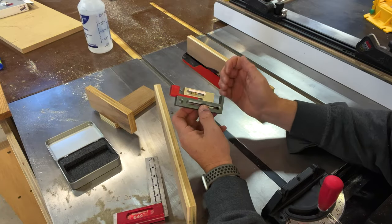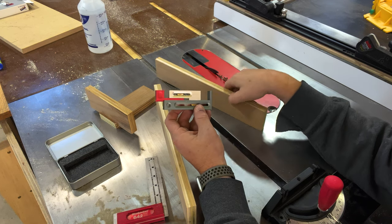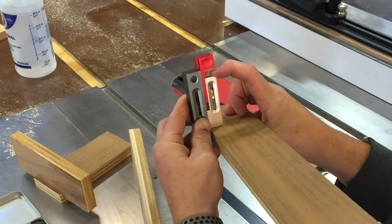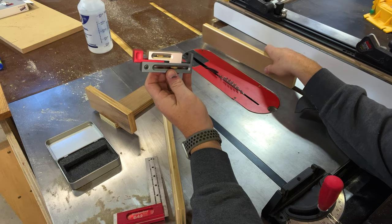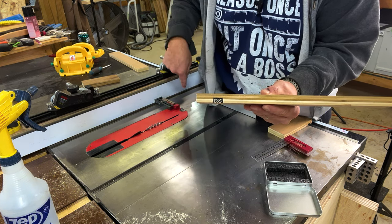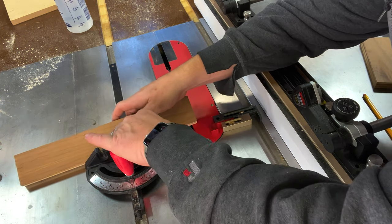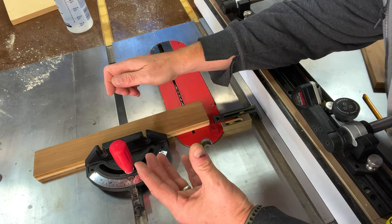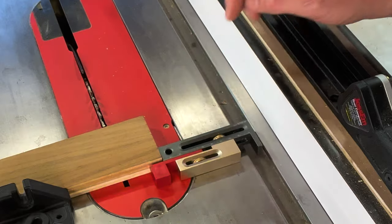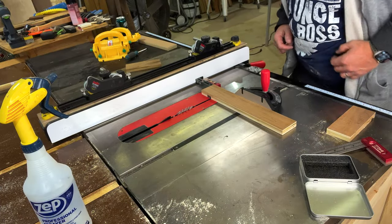Now that we have the kerf of the blade figured out, it's time to figure out how thick the dado should be. We take our workpiece and create a slot where our actual workpiece will fit into, creating a tight fit by pushing this knob. Then we take this to the fence of the table saw. On the workpiece, I've penciled in an area where I want the dado to land. The first thing we do is find the left-hand side of that dado, then place our workpiece on the miter gauge so the saw blade will cut on the inside of that dado for the first cut. Then we take our jig and place the workpiece against the gray metal bar and move the fence so everything's aligned perfectly. Once aligned, we lock down the fence and make our first cut.